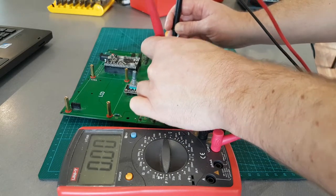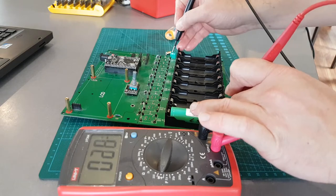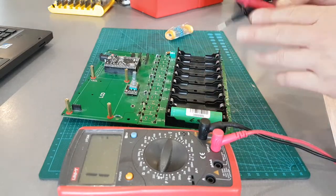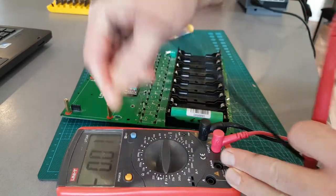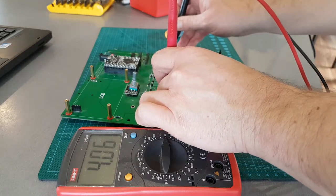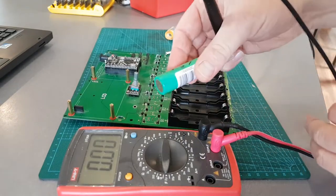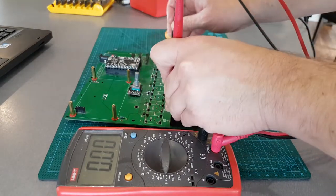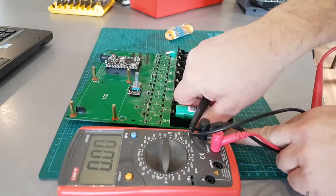Put it in diode mode on the one without a battery - it's dead, there's nothing. The MOSFET is not turned on. That's how you test it - check the positive and the negative. To test reverse polarity protection: put in reverse polarity, check positive and negative - that's zero, working as expected. Put it back with the correct polarity, see the voltage - that's how it works, very simple. Just one N-channel MOSFET as part of the reverse polarity protection.